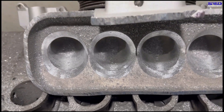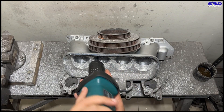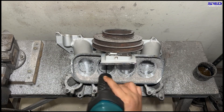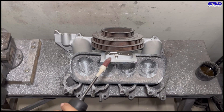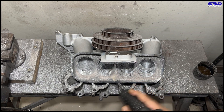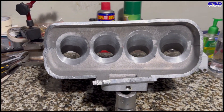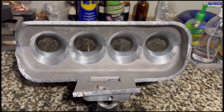We continue going a little bit deeper so we can show you it's almost done. We go deeper now to include at least halfway of the runner length. We're going farther into the deep end to maintain consistent taper. Even though we're not yet done, we ran an 80 grit first on the entry — just the entry — so that later when we wash it up to show you guys halfway through, you can actually see the improvements on the taper entry.